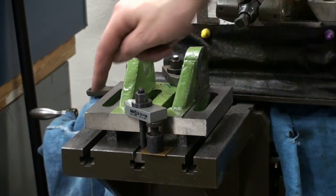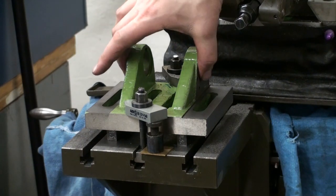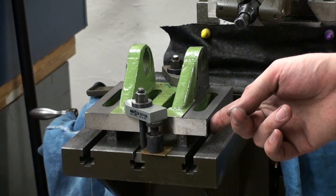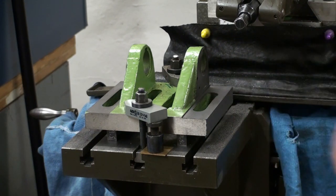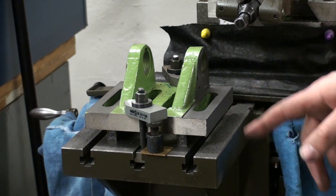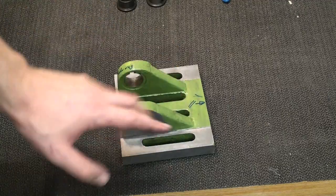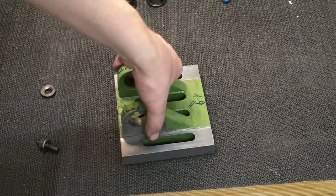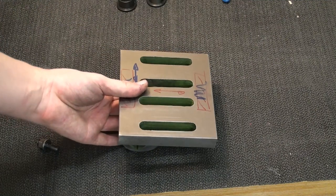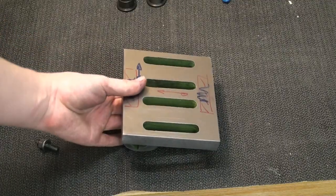Okay, I machined the two outer areas, the side walls of the bearing mount and the outer walls of the casting all in one setup. They're all in line now. And we can tear down this setup. Okay, I get the part out of the shaper, and next thing we're going to do is set it up on the milling machine upside down like this, level it out, and then we will clean up the slots.